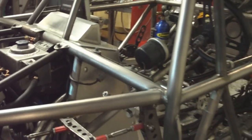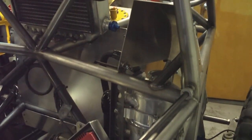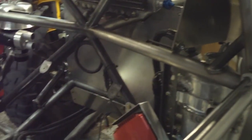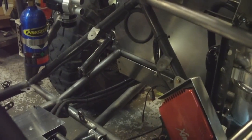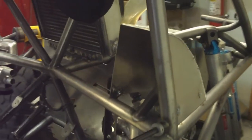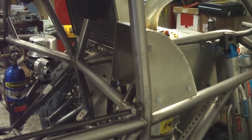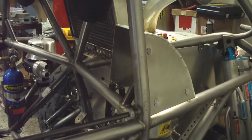This isn't all that exciting but it's part of the rules — it's a brake switch for the brake light. We got our brake lights now this year and I'll show you that in the back. On to the theme of cooling: we were going to add an oil cooler but kind of opted not to because the only space we had for it was down here, which is where the tranny cooler used to be. It's just not a very effective place, so we opted to put a scoop on it and we're thinking that's going to draw some air in there. We never really had issues with cooling on that, so it's above and beyond what we had before.